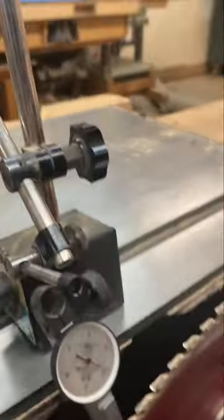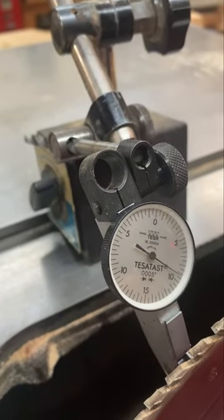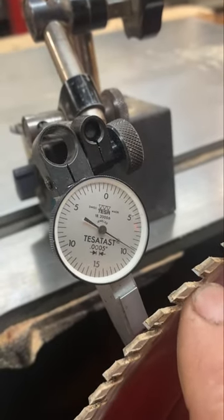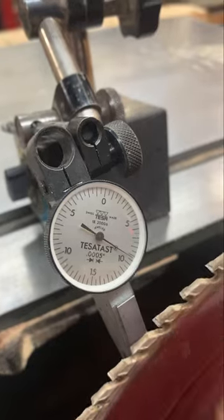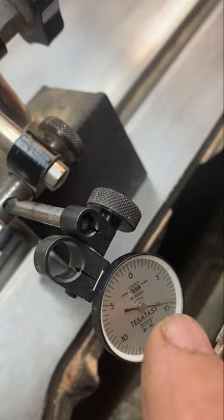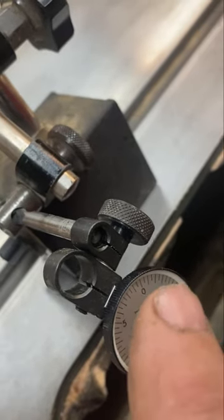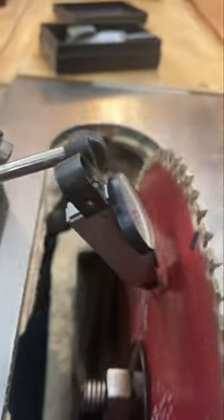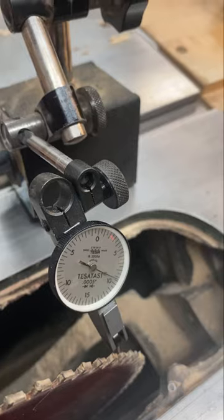The thing to do is to put a blade in — let me show you how sensitive this indicator is. Each one of those indications is half a thousandth of an inch; from there to there is about five thousandths of an inch, less than two sheets of paper. You can get little outfits that go inside your groove — just drop your magnetic edge in here, it has a center thing, and read your indicator across that. This one happens to be five thousandths of an inch out.